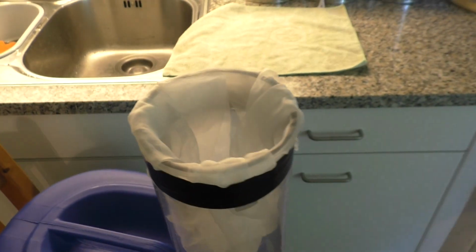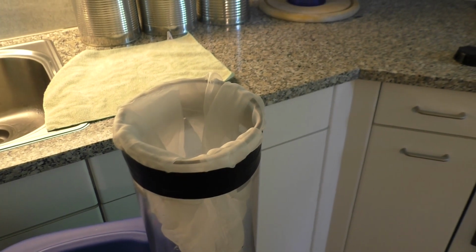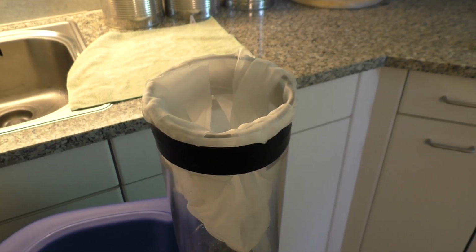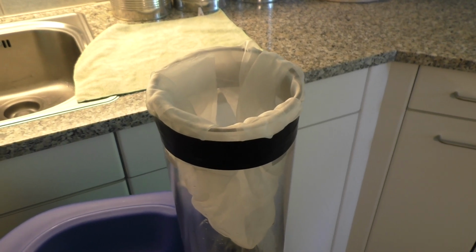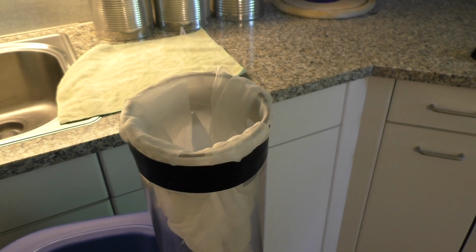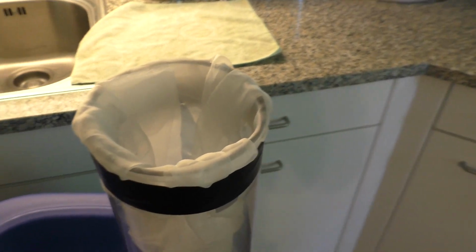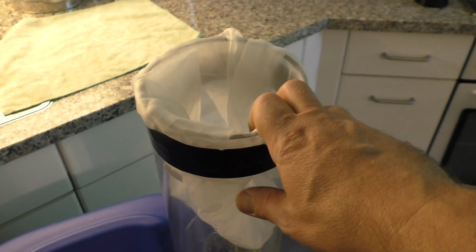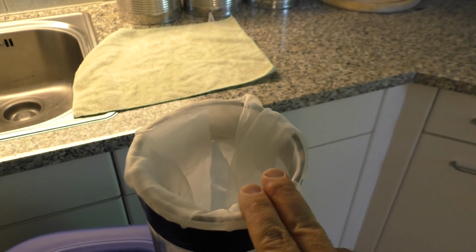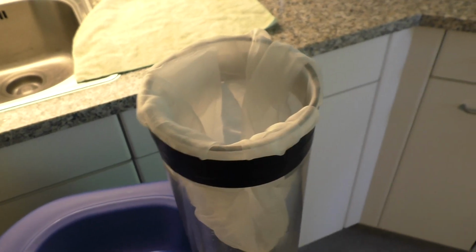I realized that when I built my first gold washing machine with a motor, with a drum that rotates, with nylon gears. And after a while, the gears lost all their teeth. So I thought, maybe a mechanical failure, but I found out it's the iron chloride that dissolves the nylon. So whatever you do, take something else.